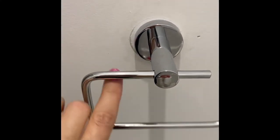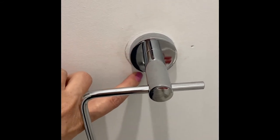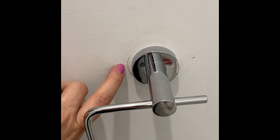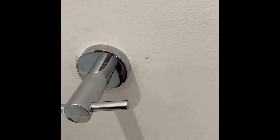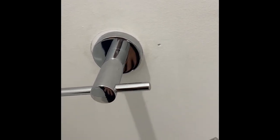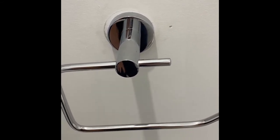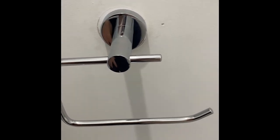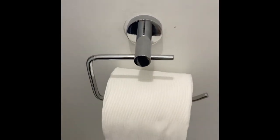There's a little bit of paint off from the previous holder, which was a larger circle, so I'll just touch that up with a really fine paintbrush and a little bit of paint — you won't even notice. And my little boo-boo putting that tiny dent in the wall — I'll use some white filler to fill that up. If you don't know how to use filler for dents in plaster walls, check out my other video that gives you a quick tutorial on how to do that. Beautiful!